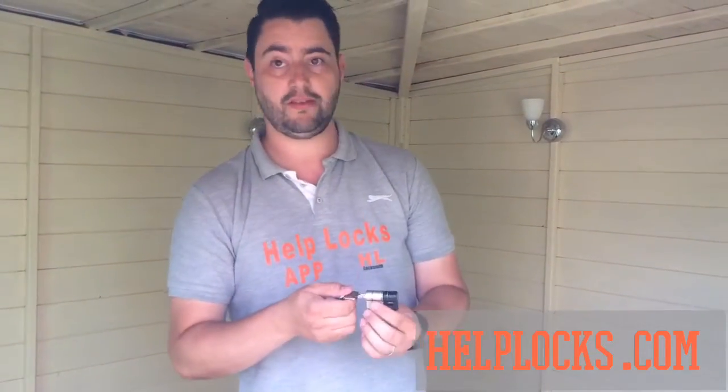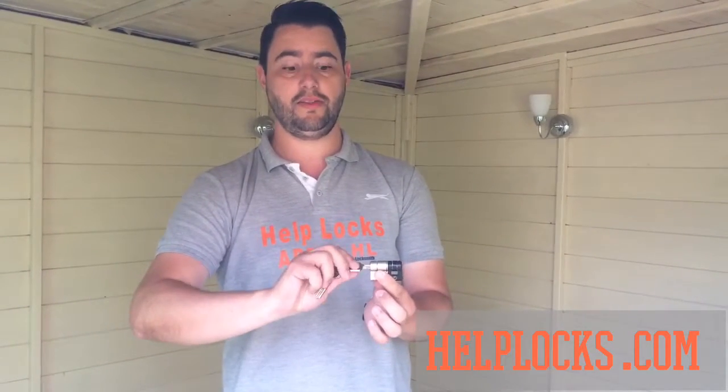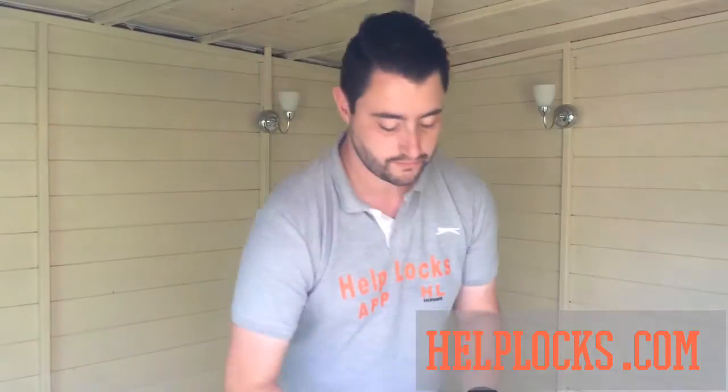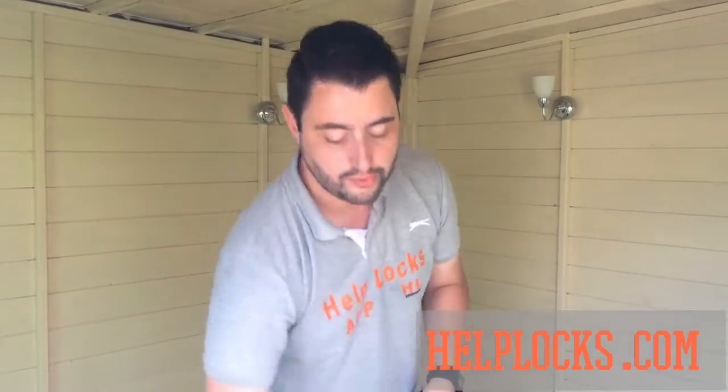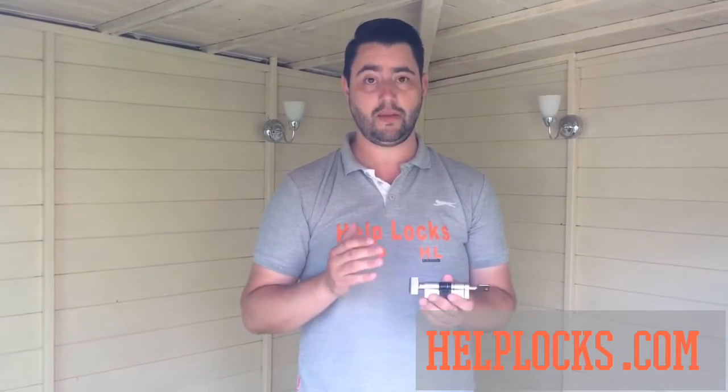That's because a firing pin has been fired into the cam to stop it from turning. But for the family who are sleeping peacefully on the inside, you can still leave your house or property no problem, and it's exactly the same with the thumb turn. One of the other benefits of having a thumb turn lock is that it's a perfect fire escape — if you need to leave your house in an emergency you can leave without having to find your keys, go straight to your door, one twist of your lock and you're out.